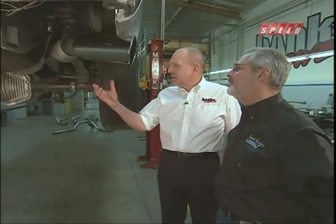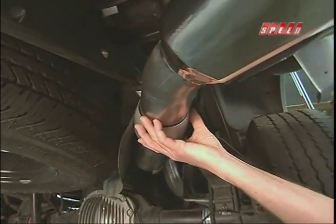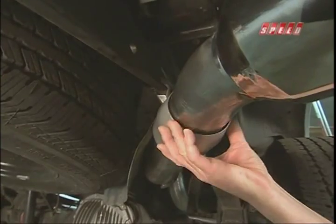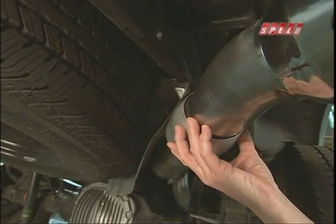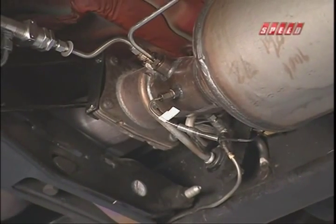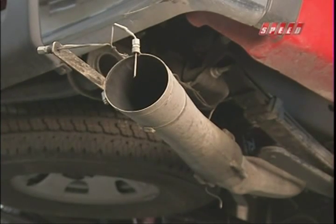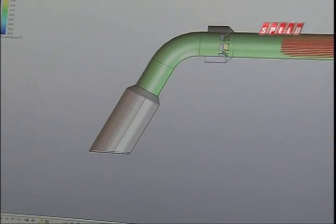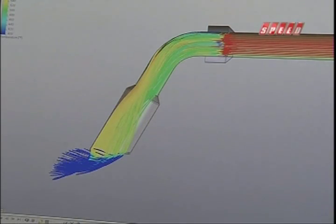So tell me how this cool cuff works. The cool cuff is a device that's in line that mixes cold air with the hot exhaust coming out of the DPF. You've got vents that are mixers and the cuff that directs air into those vents. Once it reaches the cool cuff, the outside air comes in and mixes with that hot exhaust, cooling it down.